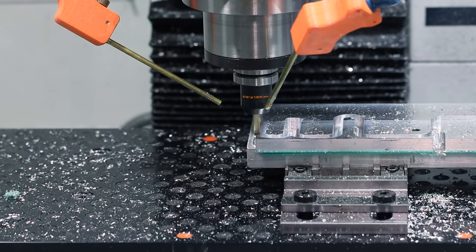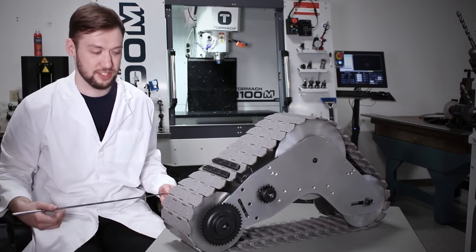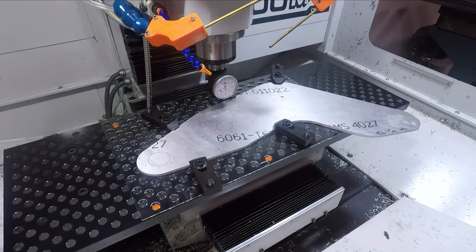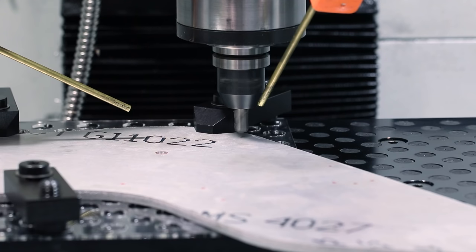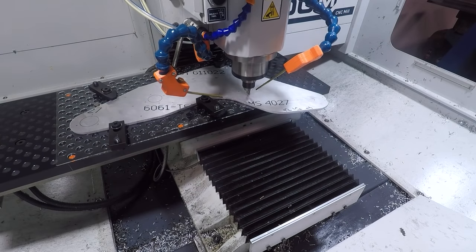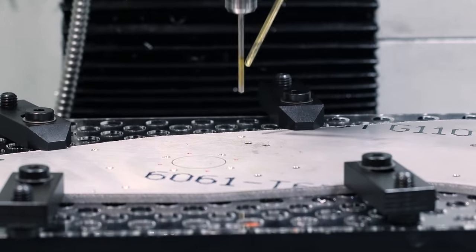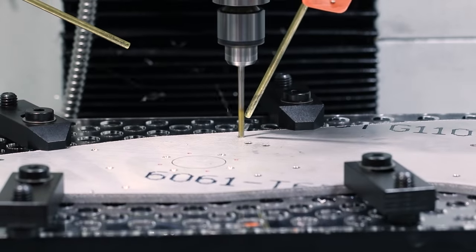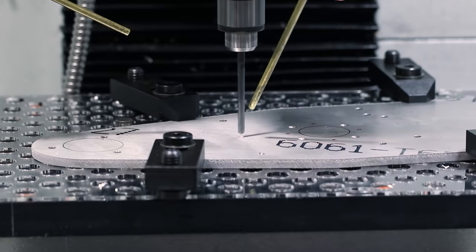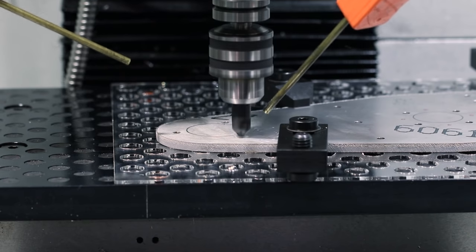Next up, Johnny Five, machining these large boomerang plates. This is a great example of where it just makes sense to put the material directly on your machine table. It's another example of where having a fixture plate really shines, but you want to put something between the fixture plate and the part — in this case, we're using our acrylic plate savers. This spaces the part up high enough so that you can machine all the way through the part, both along the periphery and through holes and other internal features, without risking machining into your plate.